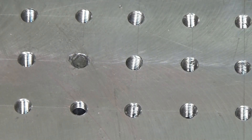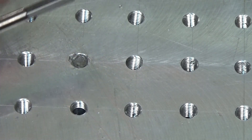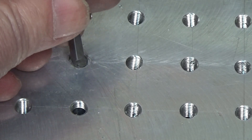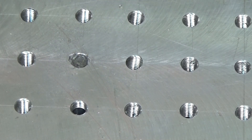I've got the tap relatively flat using a diamond burr. This drill that I purchased is called an Omega drill and it's designed for drilling out broken taps. It's got a triangular shape to it, and the instructions recommend that you try and get the tap as flat as possible, because of course they don't break off nice and neat. Now I'm going to take it over and mount it up in the drill press and see what we can do with it.